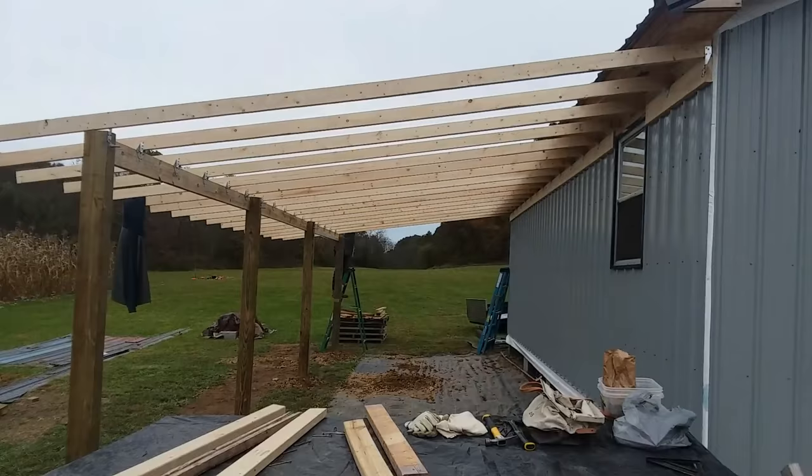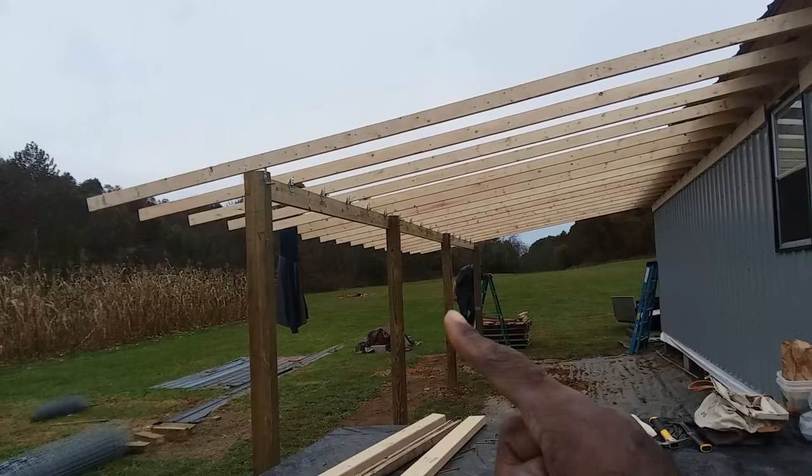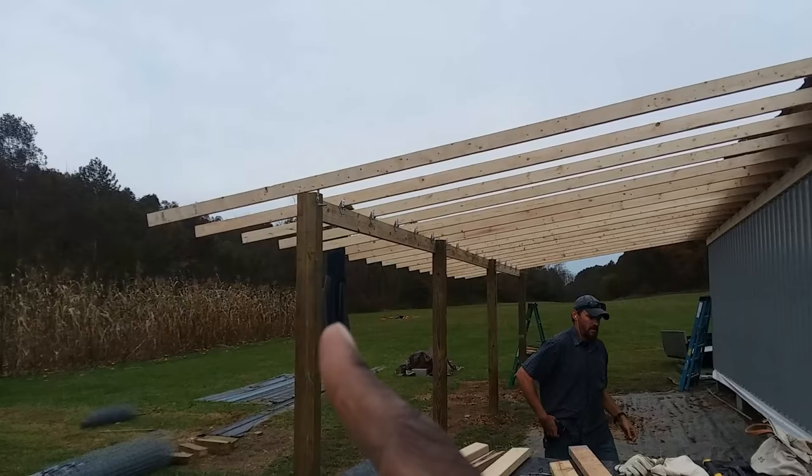Now Dick is about to go through, measure, and start cutting off. I'm going to take some 4x4s and brace along this side, these posts, to the 2x6, and I've got carriage bolts that I'm going to put into the 2x6, and also the 4x6 to the 4x4. So I'll come back on a little bit later, show you guys where we're at.